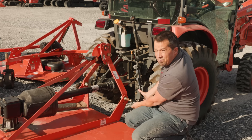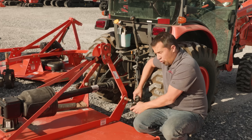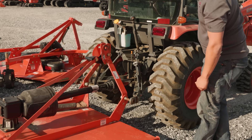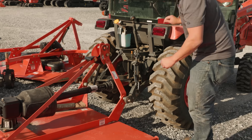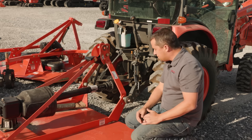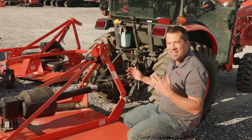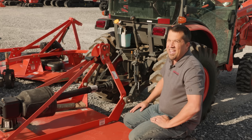Once we're close I'm going to reach back here to my three-point hitch, pull out the pins from my sway bar, and then lift this up and slide this over the end. Now you can see I'm a little bit off, and this is where we've got options. This deluxe tractor has an extendable link arm — I can push this plate down and pull the ball end out so that when I lift to go over top of the pin I have a little bit of flexibility. Many tractors do not have this extendable arm, so what do we do? We get it close and you take your boot and pound it to get that over top — this kind of pounding is totally normal on your three-point. With loaders and skid steer couplers you often don't have to manhandle your machine, but an old-school three-point hitch isn't quite that easy, so using the boot to get the pins over top of the balls is totally normal.